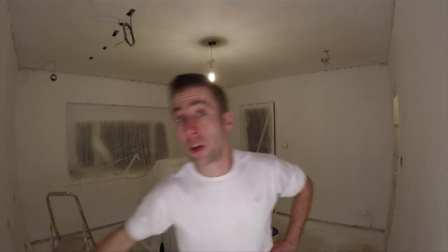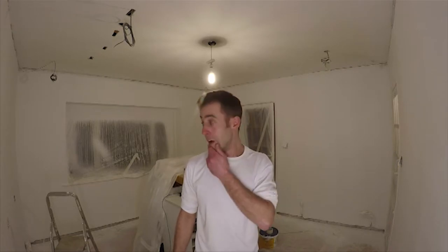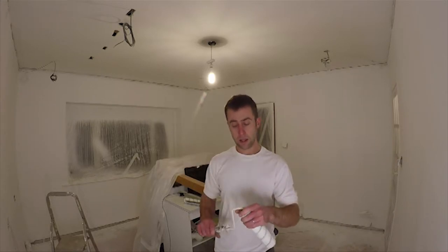So that's the two mist coats and the base coat on, and it's looking good enough to put the colours on now. The colours we're going to use are two: this feature wall is going to be a dark grey called natural slate, and the other three walls will be a lighter grey called polished pebble. We'll apply these exactly the same as the base coat — in the corners, around plug sockets, a nice thin coat with the brush. Now that the base coat's on with the roller, I've got that slightly dimpled texture on the walls. Using a thin coat with the brush will maintain that texture, and I don't want to see any brush strokes. After the brush, I'll use a smooth surface roller with quite a short pile, then leave it a few hours and do the final coat later.